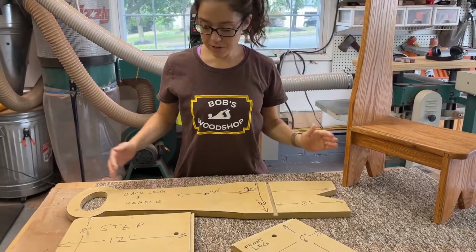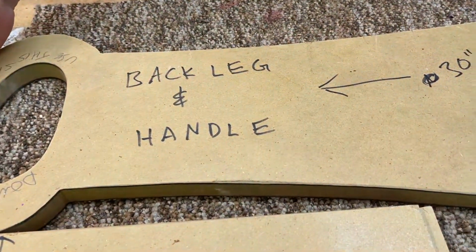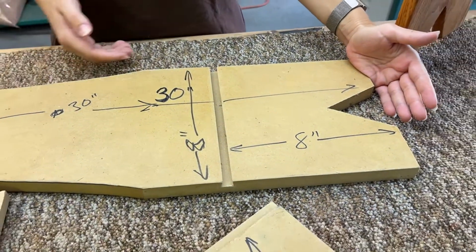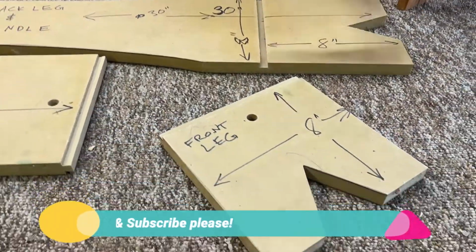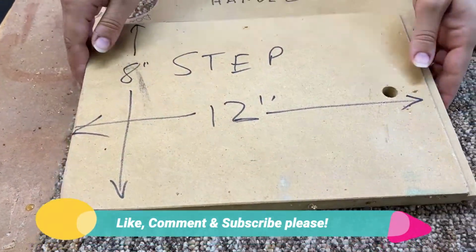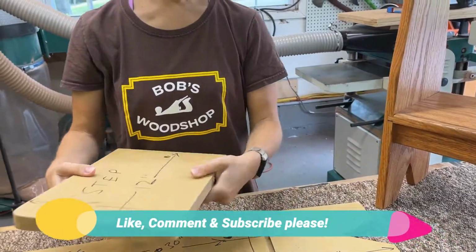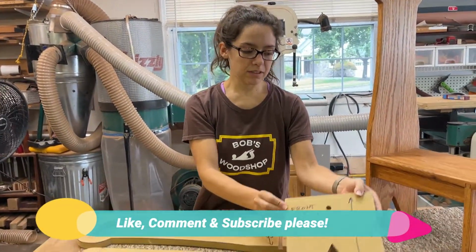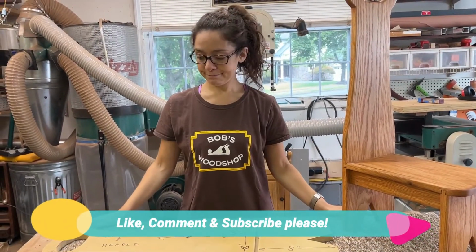The first one is this guy, who is in total 30 inches long. And this is the back leg and the handle, so everything's pretty much 8 inches other than 30, so 8, 8, 30. And then we have the step itself, which goes here. This part is 1 foot long, but it's 8 inches high. And then the front leg obviously is 8 inches high as well, so it is balanced.